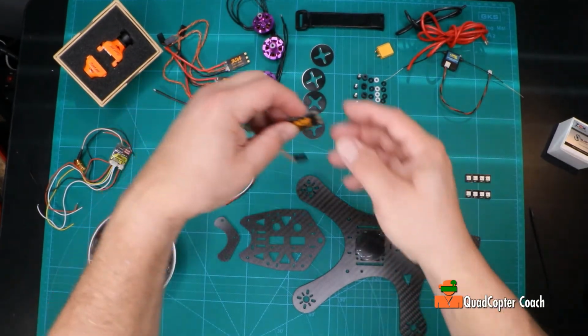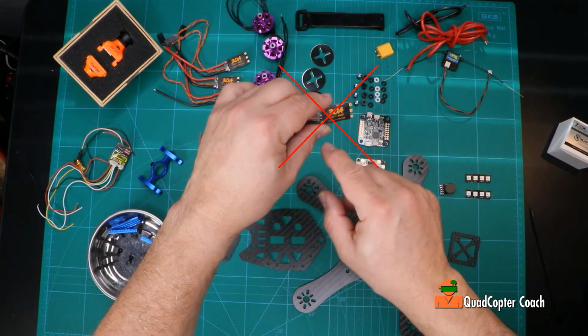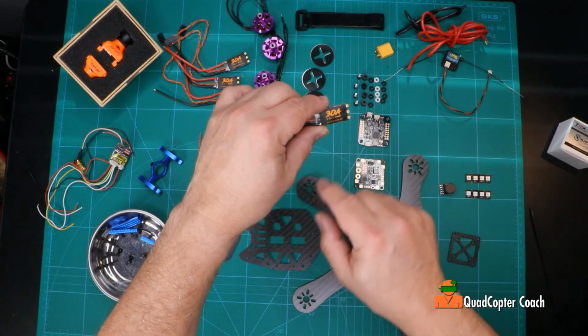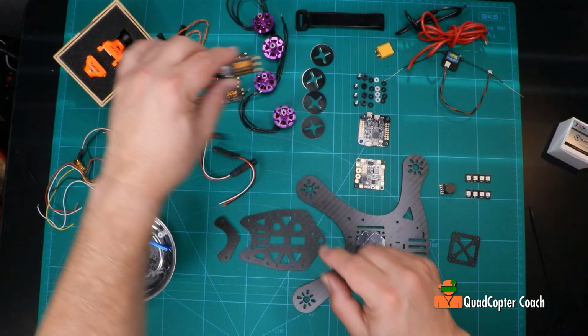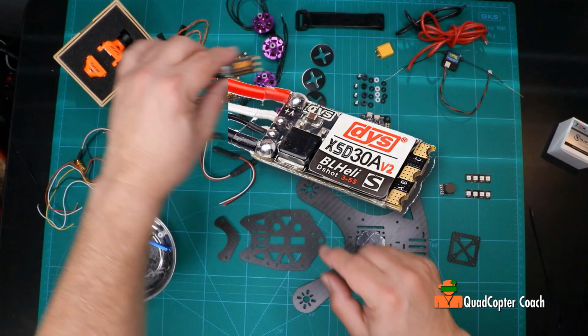Also in the Dropbox came with their own branded Dropbox 30 amp D-Shot ESCs, and these will work up to 4S, which is perfect for me. Strike 2. The ESCs from Dropbox were dead on arrival. After I built the quad, I could not get BL HeliSuite, either 32 or 64-bit, to talk to them. All I could get was startup tones. So these $10 ESCs were replaced with $17 DYS XSD 30 amp V2 ESCs, and they worked great.